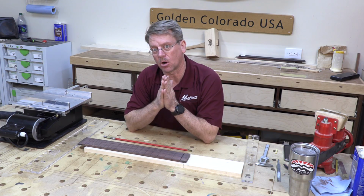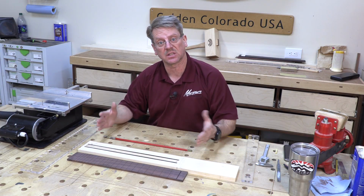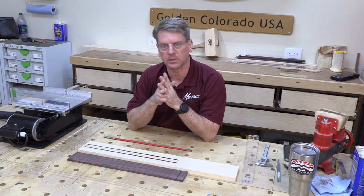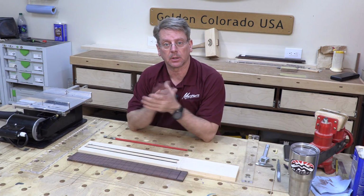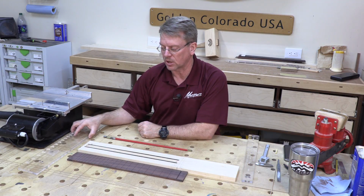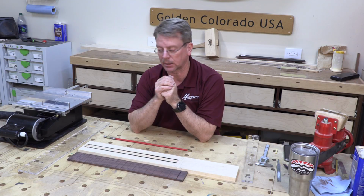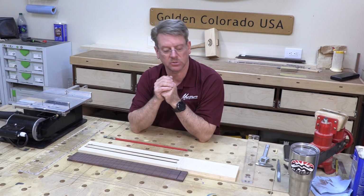But right now, all we really needed to see was the fret slot cutting techniques and how we're utilizing the template system with the locator pin bushing, drill bushings inserted in that, and how the alignment is just going to be pretty simple and hopefully foolproof for the students in my class. And for everyone else out there in the world who's checking this out, it's not a hard thing to figure out where your neck is going to lie on that template, and do the CAD yourself if you have that capability, and have somebody cut that template out if you don't have a laser cutter, and you can have the same basic alignment system.